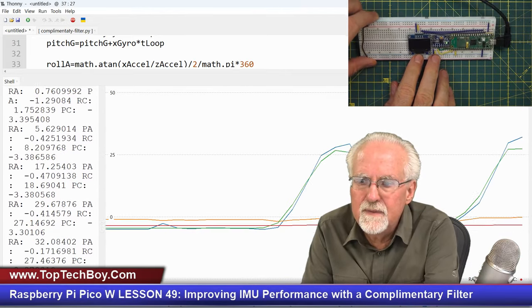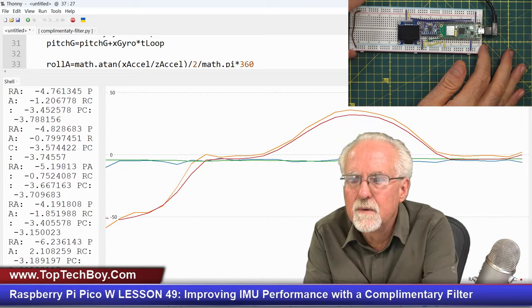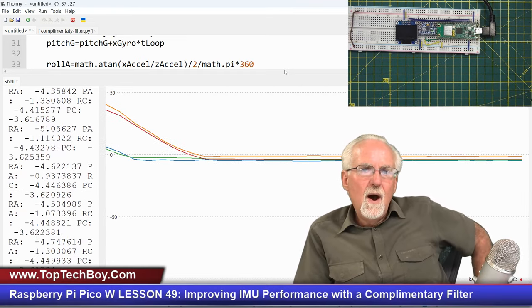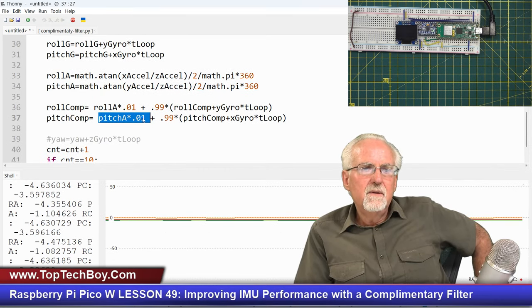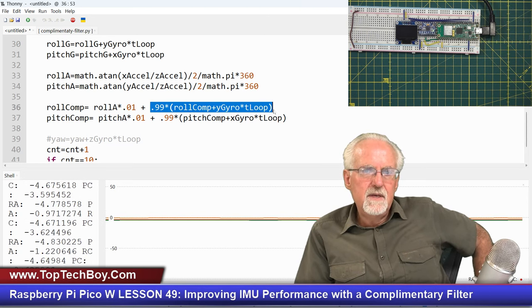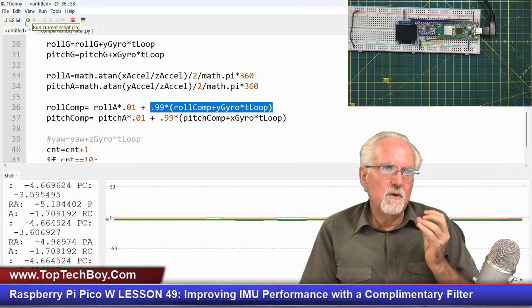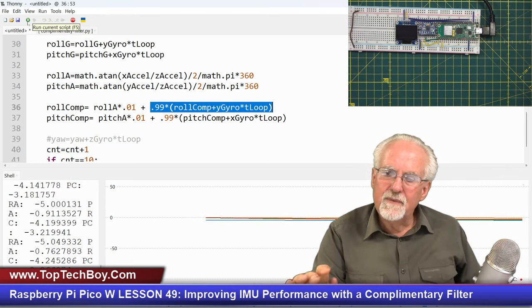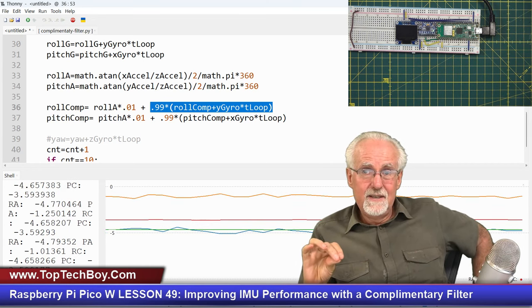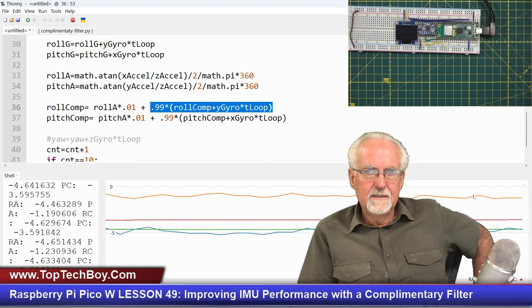Now, you wouldn't see it when I did this, okay? You wouldn't see it when I did this. When I do that, you hardly even see it, okay? But there's a little gap between those two. Why is there a little gap between those two? Because this is my rock, but I am looking so much at this one, there's a tendency for the rock to be fighting the drift, and they come to something where they settle to a constant value. This is not a drift between the orange and the red. This is kind of like a steady state tiny error, maybe 1 degree between here and here. Okay, are we happy with that?